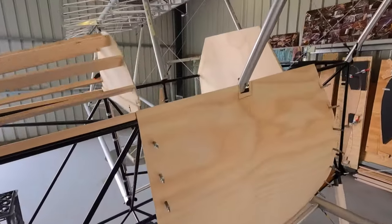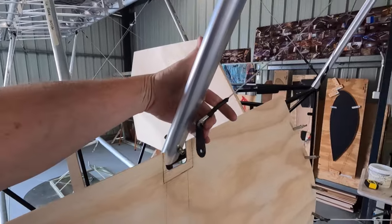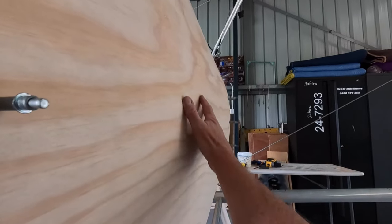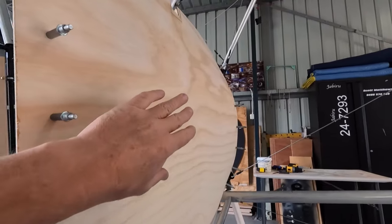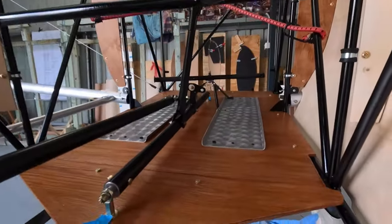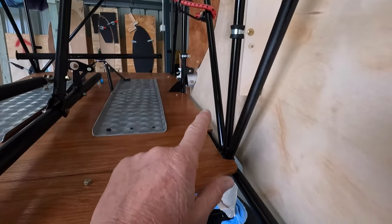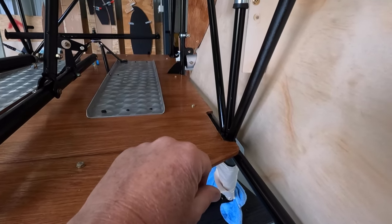Side skins Clicoed on, did my patchwork up here, so that's all nice and neat now. I dropped the cable - that can go back on. I need to neaten up the dashboard so the angle's right there. I'm just looking at the curves, making sure there's no oil canning or indentations - she's got nice curves on her. It's flat at the back, with a curve at the front. Looking pretty good, structurally sound. Now I just need to work out along the bottom how I'm going to secure that to the floor, just up the front there. I think I'll just run a bracket and bolt it on.